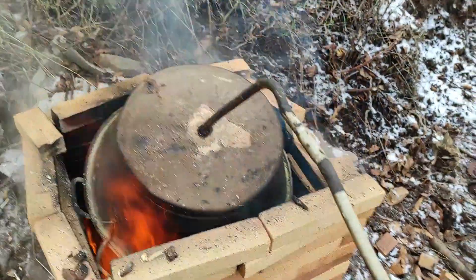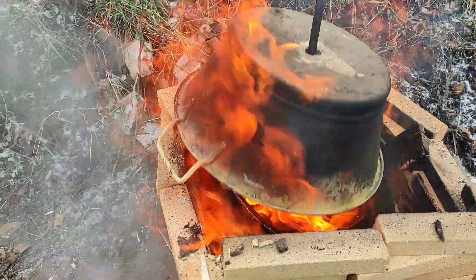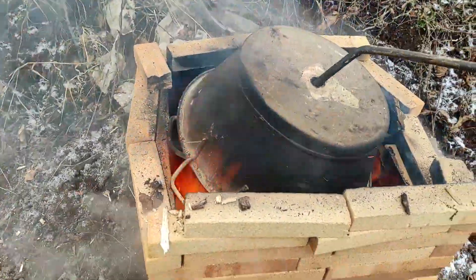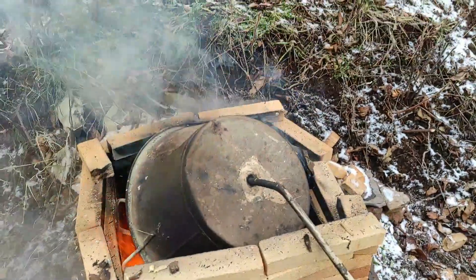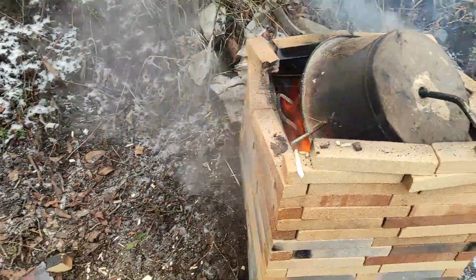As you can see by the flames, the wood is not done decomposing yet. You know it's finished when you don't see any more smoke coming out. It usually takes between 1 and 2 hours for me with this furnace, but I think it can probably be done in less than 30 minutes with a real furnace and by using less wood.